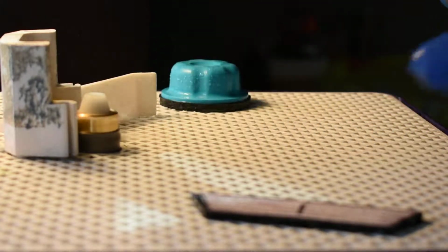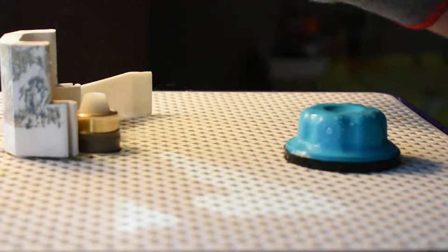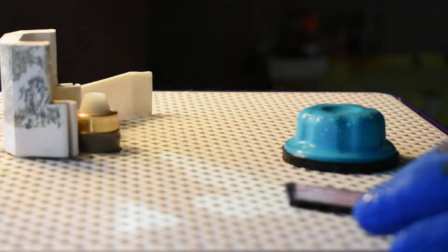Alright, so let's start the glass, get our eye protection on, and start the grinder, sorry. There we go, and the water is going. So we're going to use the grinder and push firmly as we go about it, and we take the excess glass off. At that point, we're then going to go through all four corners and just smooth out the edges. We don't want to have any fragments that are chipping, especially with the third stage of glass making. You do not want to have any indents. You want to have a nice smooth line. Alright, so let's start grinding.